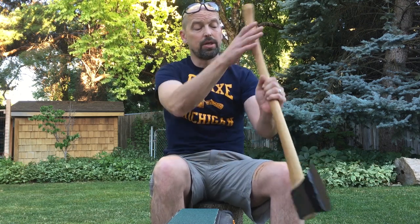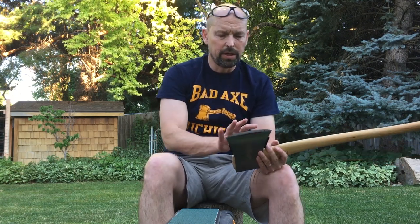you get closer, you've got to check constantly from the toe end a lot. You really got to eyeball it to see if you're bringing those bevels in evenly, or whether they're kind of wavy or something. You've got to look at both ends, because you could go hard on one side, not the other, and it kind of gets off. So you've got to eyeball it in and bring it together. And I finally brought it down. And so check it.